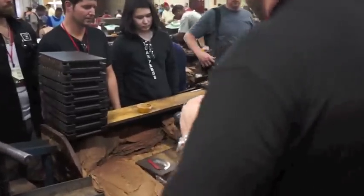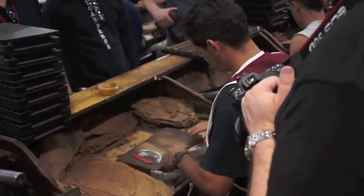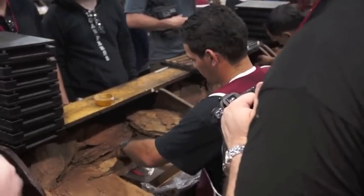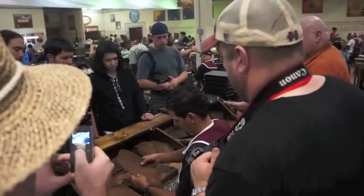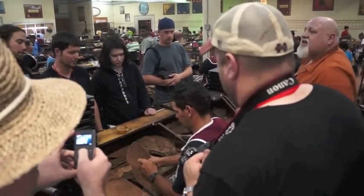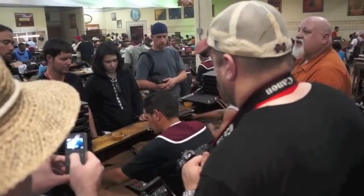It begins with laying 1 binder on the tablet, not 2. Okay? Now, when he lays the 1 binder, he just simply stretches it. The next step is to do what we call base. He takes a separate leaf in his hand. Okay, you see him doing this now. He kind of folds it over once, over onto itself, and then he'll fold it back again. He's trying to create a platform in his left hand through the bunch shot.